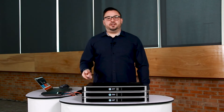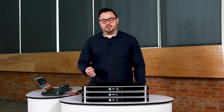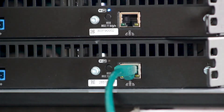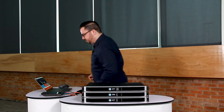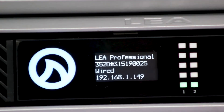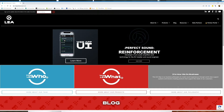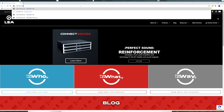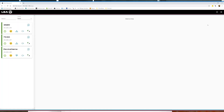And there we go. So the second way to configure the amp to connect via Wi-Fi is first via a wired connection. So this bottom amplifier, we're going to connect wired now and configure this from my computer. Now that it's plugged in, let's take a look at what the IP address is. Here we've got 192.168.1.149. Come around to my computer here, type that in. It's pulling up the settings for the amplifier — it just takes a second.